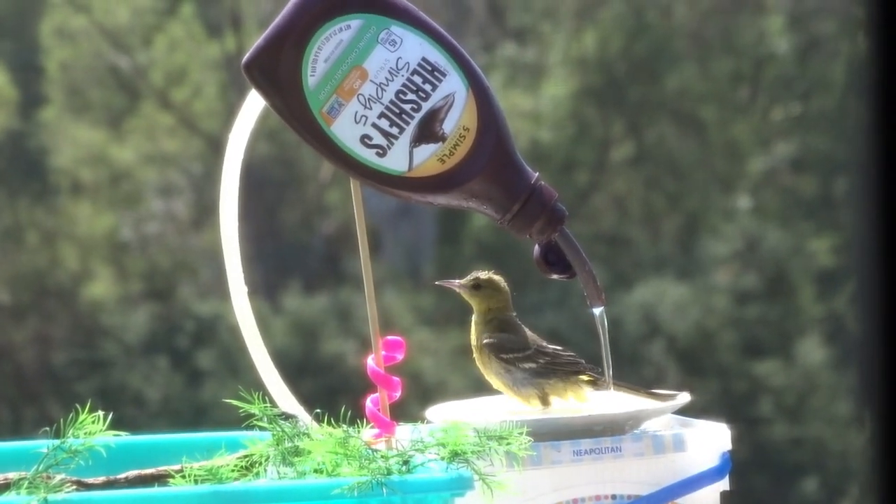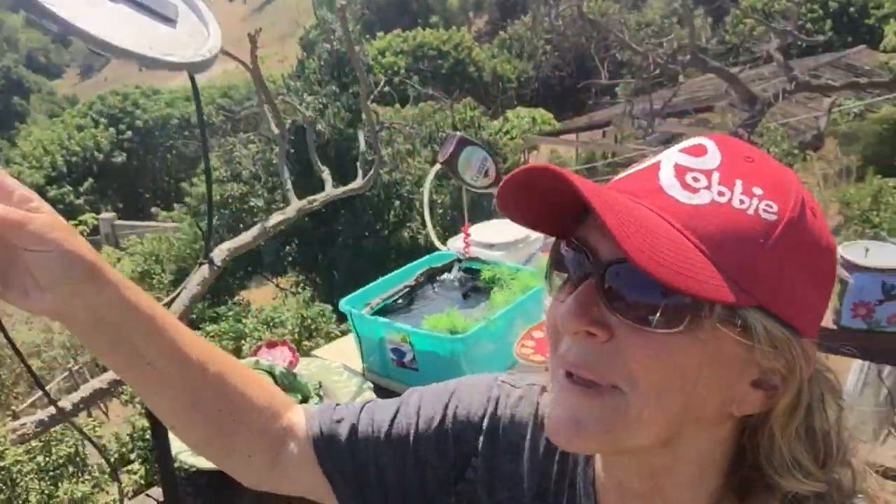There's basically nothing in these — it's a magnet that spins from the solar panels. I've got solar panels here and they're interchangeable, so you can test it on different ones. I haven't had a pump break — they have their issues sometimes. You can flush them using a squirt water bottle — like an empty ketchup bottle — put it in the hole and flush everything backwards. I've also flushed down the tube connected to it, and I've taken them apart and cleaned them.